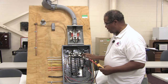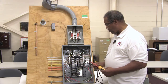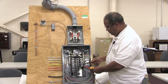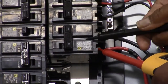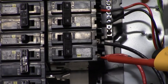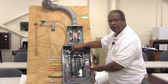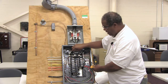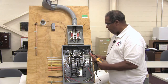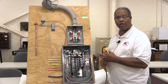From the main circuit breaker, once you know the voltage is present, it'll be a matter of checking the individual breakers. You would go down to the side, determining what circuit you want to check. For example, on this two-pole breaker, you would check it by putting your lead at the very end on the screw-in lug and then taking it over to the neutral to determine if you have a voltage source. If you do have a reading, then you know that one is fine. That is the proper way to determine if you have a voltage source at your panel in your home.